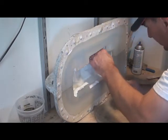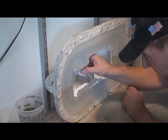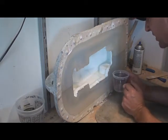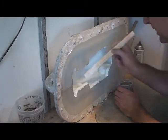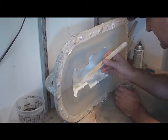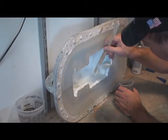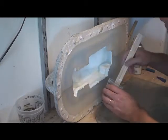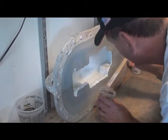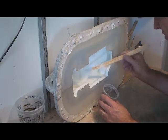If I ever build this mold again I'll eliminate those sharp corners and give you a little bit of a radius down in those corners. But it doesn't matter because your wheels don't go in that far anyway. Unfortunately this winds up giving us some really thick spots on the sides that I don't like, but there's no way around it. If you get thick areas, sometimes it tends to pull the plastic because as it shrinks the body skin on the outside isn't as thick as this area we're pouring in, and it tends to pull those areas a little bit. But I think we're doing it good this time. The material is starting to thicken up now, so it works more like a gel.